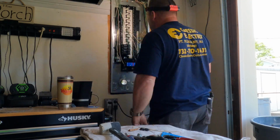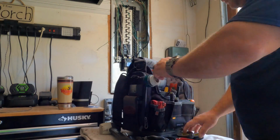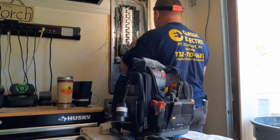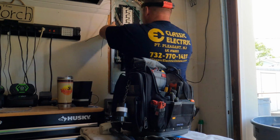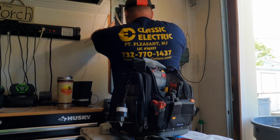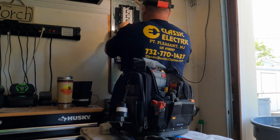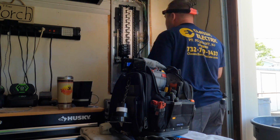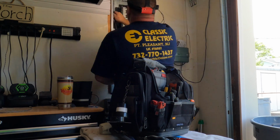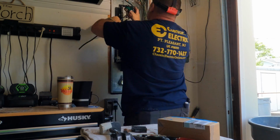Here in New Jersey, we are still on the National Electric Code 2017. The 2020 NEC was updated to provide surge protection anytime I do a job like this, like a service upgrade or a new service. Although it wasn't required here, this was an added feature to this particular job that we did. The two-pole surge protector device protects the whole house and each circuit inside the panel.